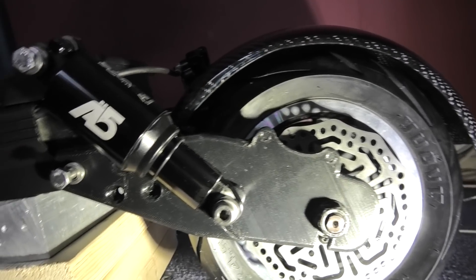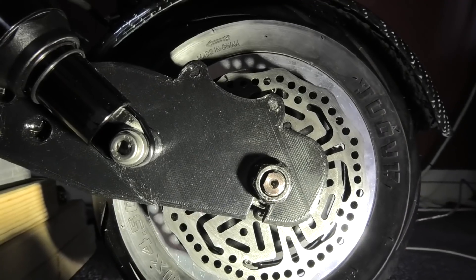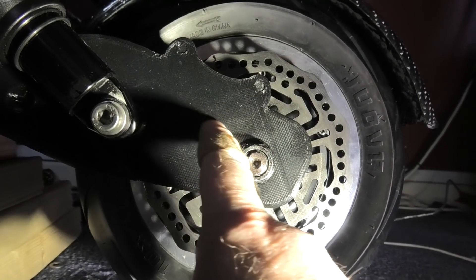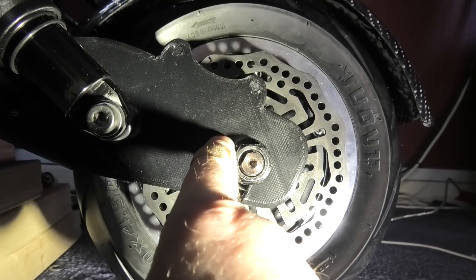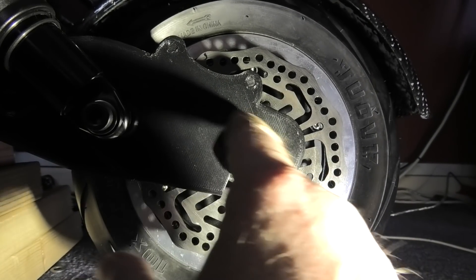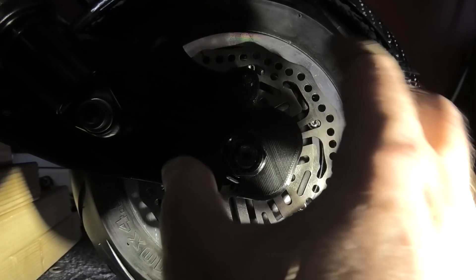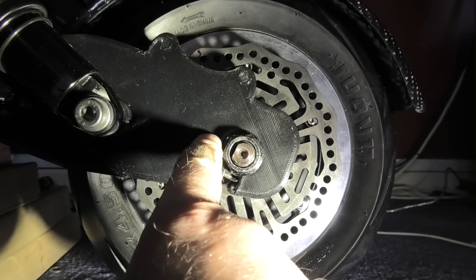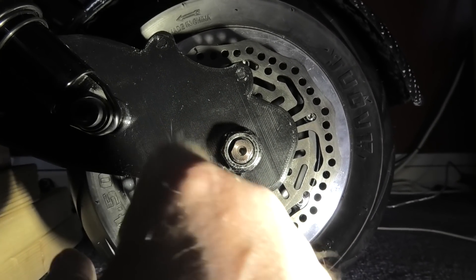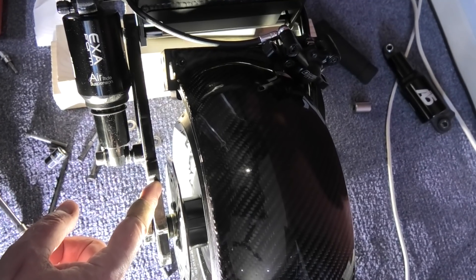What I've got to do now is redesign it because I want to incorporate a torque arm into the swinging arm. I may do a cutout along here and make my own torque arm. I'm not decided yet whether to put it on the outside or the inside. This is going to be the positive pattern, so I'll make the negative pattern of it so I can do it forged.